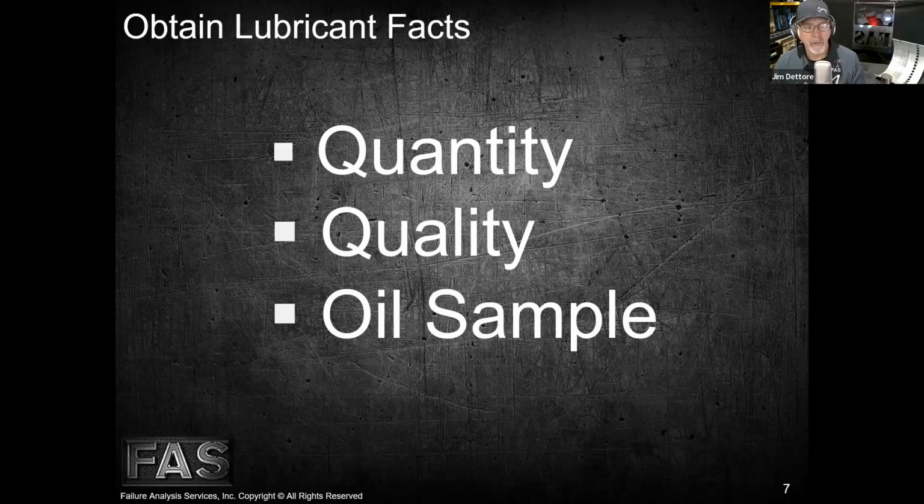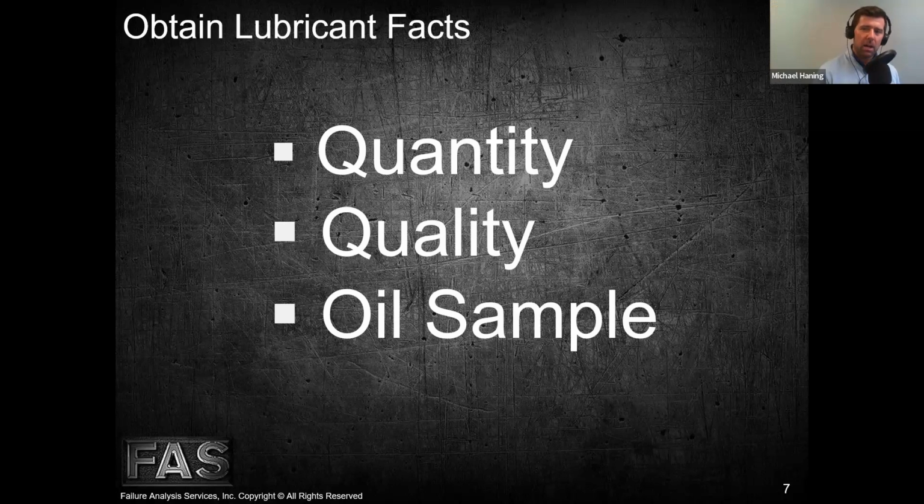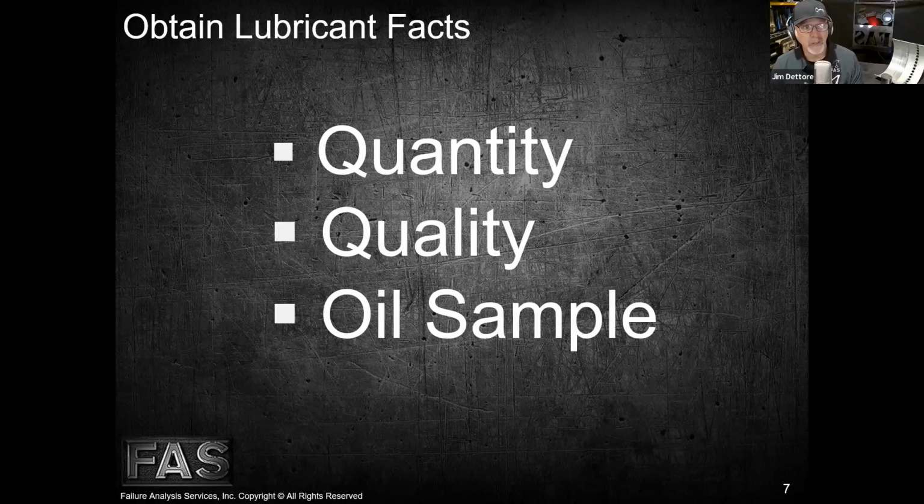When we take an oil sample, to start with, it's important that we take the sample while the oil's hot, if at all possible. This is what helps keep particles in suspension in the oil, which allows us to get a good representation of what the oil's acting like while the unit's running. In terms of hours, if there's a failure, a crash, how much time do you have to get in there and get a good oil sample? Oh, geez, that's going to be relative to ambient temperature, but I don't know for sure.